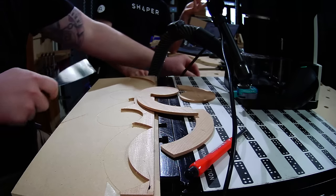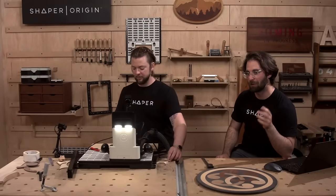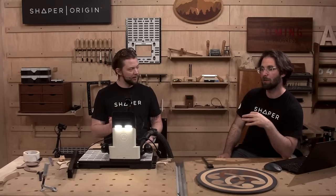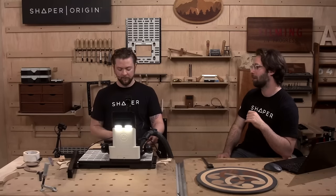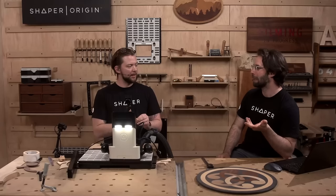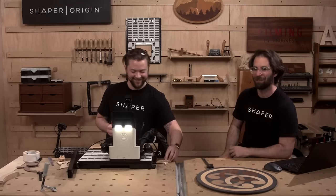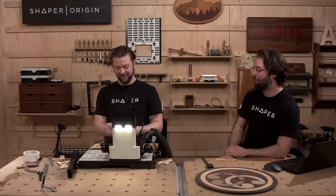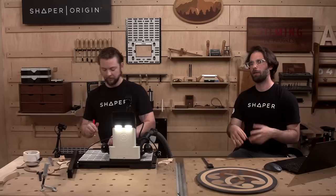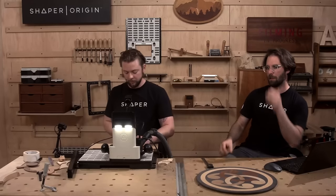Thinner inlays can go down to as thin as 1/42nd of an inch, which is a weird fraction. But the easy way to remember that is that it's about 0.02 inches or half a millimeter. I think that was a metric measurement originally, because half a millimeter is really easy to remember. And then they just fractionized it, right? Let's fractionize that for the U.S. folks. So we have two categories: thicker shop sawn veneers, and thinner commercial veneers, with different advantages and disadvantages to each.